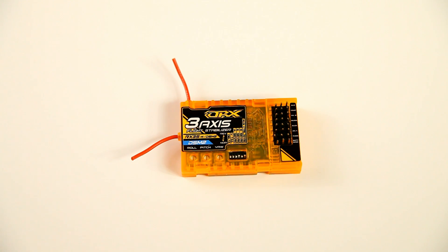This is two products in one really. It's a DSM-2 receiver, so for Spektrum radios for instance. It's not DSM-X by the way, it's the older protocol. And apart from that it stabilizes your airplane in three axes — in bank, yaw, and in pitch. And of course it also outputs the throttle signal for you.